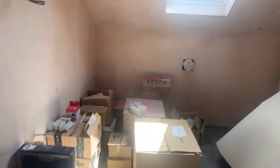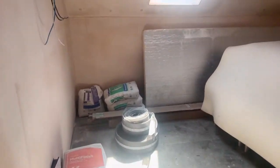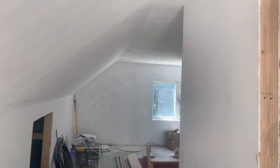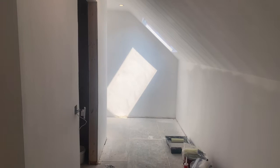All these rooms upstairs are just being used as storage areas at the moment, as you can imagine - there's an awful lot of kit to go into the house. The office/guest bedroom has some extra bits of skim, dining chairs, extra insulation boards, and TV mounting brackets. Coming back around, if I pop out here the PIR will catch me - and there you go, the lights have turned on. It's quite bright in here. I can actually turn the PIRs down so the lux level they're dictated by is adjusted. On a bright day they'll turn on with very little light in the area, so I'm going to adjust them when we move in - I don't want the lights turning on if we have enough natural daylight.